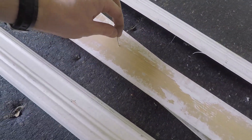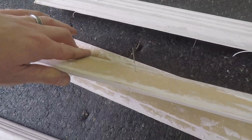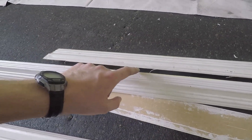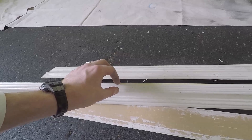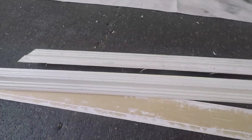A lot of the time in newer builds, what happens is they glue it and nail it to the wall, as you can see there. So no glue was used here, but what they do is they put a little bit of DAP — I think it's called DAP — it's basically a white silicone, and they just put it on the top. This way it kind of blends to the wall, so if there's any deviations between the wall not being straight and your MDF — most of the time it's MDF now — you won't see those gaps, and it'll just smooth over like one seamless baseboard. It looks really good that way. So if you have the same situation as mine and it's not glued to the wall, what you do is take an X-Acto knife or a knife, go all the way around the top, kind of cut it free from the wall, then pry it open — comes off real easy.